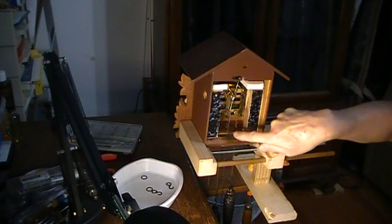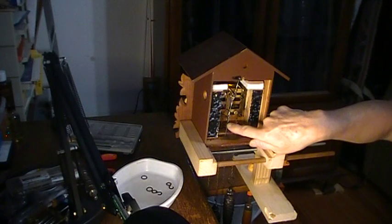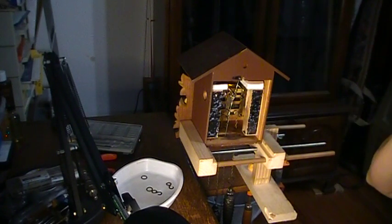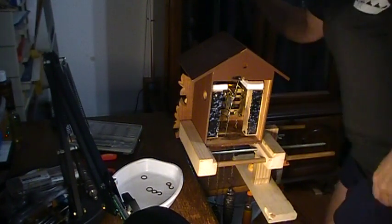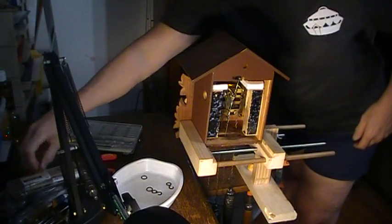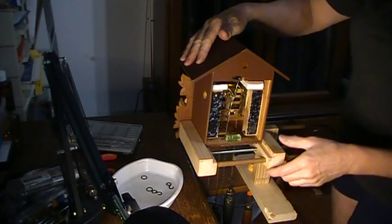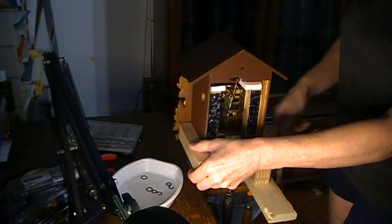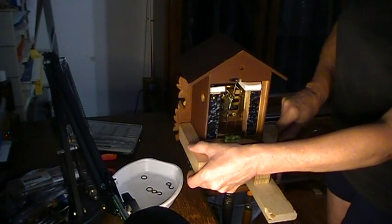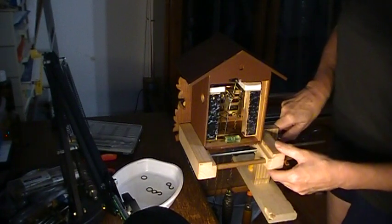Right now my pendulum leader wire is in the very front of my crutch. It's not going to stay running very good right there because there's not room for it to go back and forth at where it's pinched at the very end right there. Let me get the level. So normally I just would go side to side and check level. All right, that's about level that way.